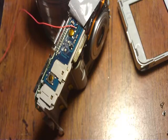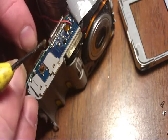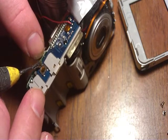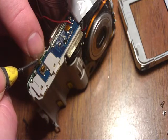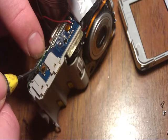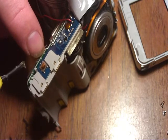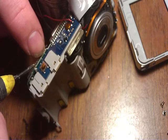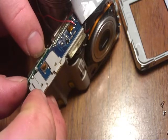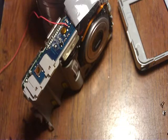Next we'll do the shutter. Over here is my shutter connection. The one on the left is focus; this one here is shutter. I'm going to solder wire to each of those posts. Now, what you could do is bridge these two — just solder a small piece of wire between the two — but I like to run separate wires to these.